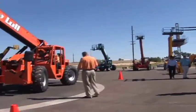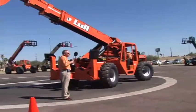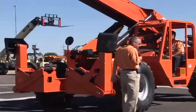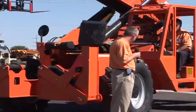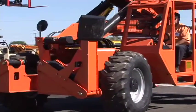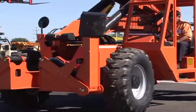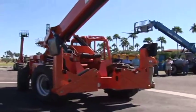Beginning at the front of the machine, like we did with the 154 this morning, we do have axle-mounted stabilizers on this machine. You can see a lot of what you've seen today. Working backwards to the tire, a 14x24 hydro-filled tire — so there is ballast in the tire. We offer tires both in lug, which you see here, and a rock tire for this, as well as a radial. Then we have the ZF axles as we move towards the front of the machine.